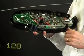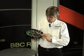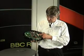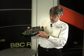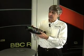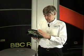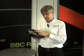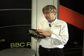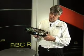There are six different levels of passive supply regulation inside the product, and here you can see the inputs and outputs at the back. Over here, an FM tuner and a DAB tuner. So you can see this is very, very compact, but also a lot of things crammed into that space. A very important part of the design of the F80 electronics is keeping the audio pure and the radio pure, with digital amplifiers, DSP and so on. A lot of work goes into the multi-layer printed circuit board screening to make sure that the radio is not interfered with at all by the operation of the product.